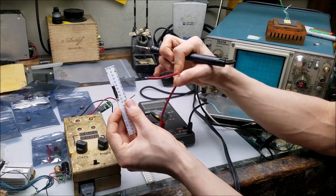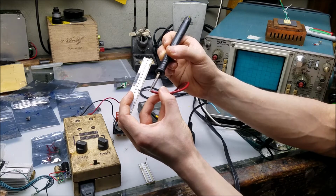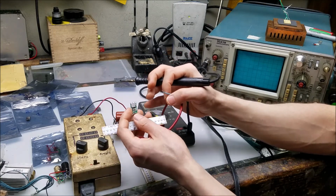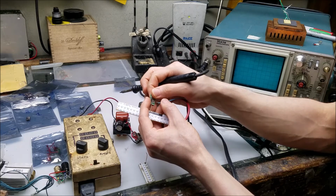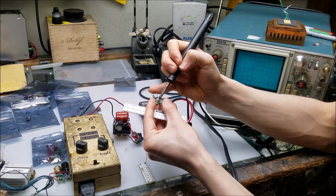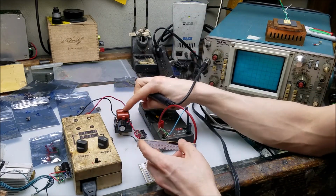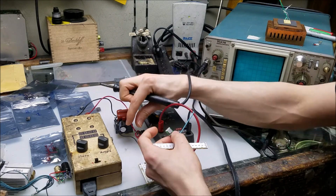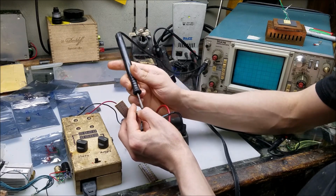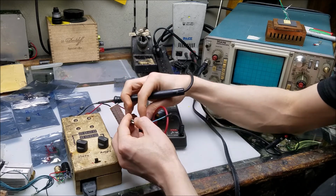I'm going to connect the negative side of my load to the positive side of the current input on my multimeter, or DC. All right, like that. I'm going to take the common and put it on the negative output, or the cathode, of the laser diode driver, just like this. Now, I'm going to connect the power supply, which as I said is giving us 4.2 volts. I've got quite a bit of filtering here, I'll talk about that later on, but for now it's just important to remember that it's set to 4.2 volts right now, just like a lithium ion battery would. All right, and then the positive.